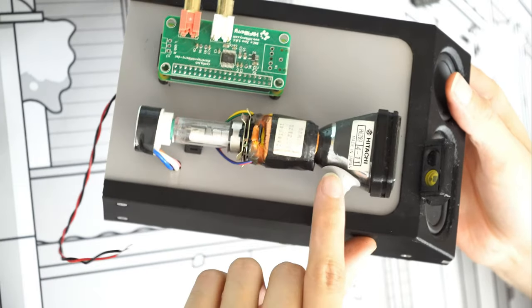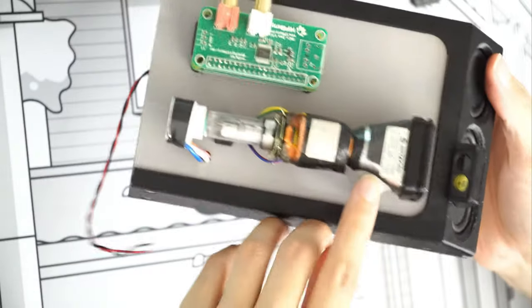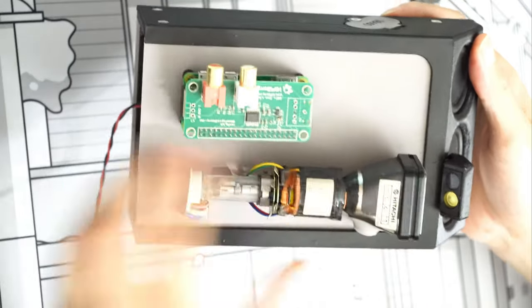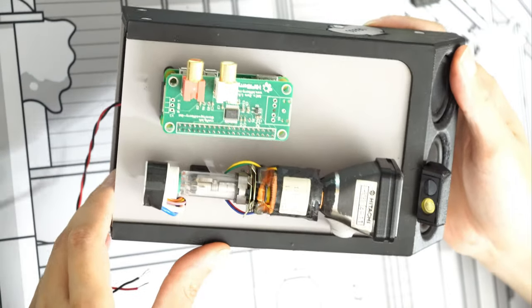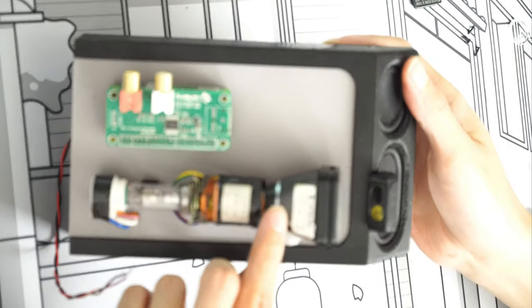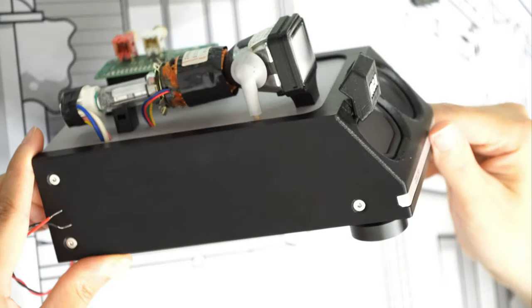Again, you need to be really careful with these tubes, because they have high voltage. And there is something else. As you can see here, the face of the tube, just like a big CRT in a monitor or TV, this is the aquadag. So this is ground. This is grounded, so it must be grounded. And as you can see, everything here is plastic.